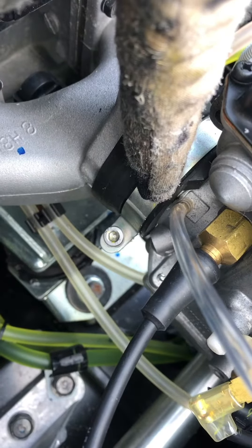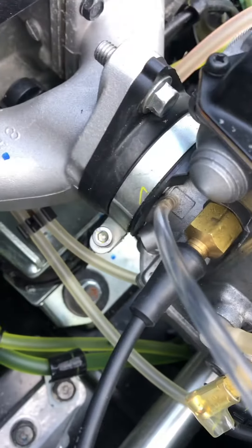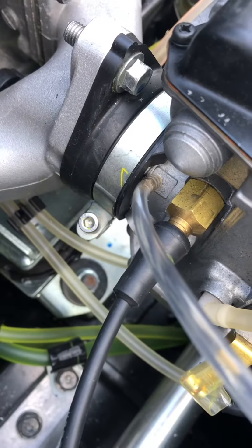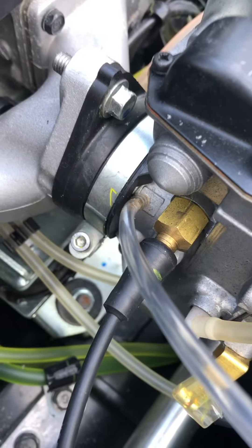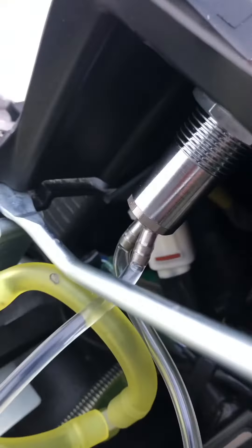I drilled right here — there's sort of a little raised patch. I took a look inside the barrel; there were no protrusions in there. So I used a little Permatex high temperature thread locking compound, drilled a 1/8 inch hole, and tapped it to 4 millimeter by 0.7 pitch. Then the nipple goes in with a 1/8 inch diameter hose.